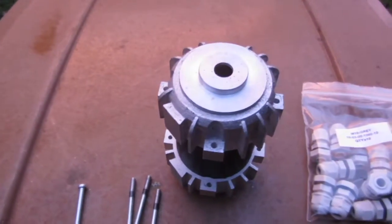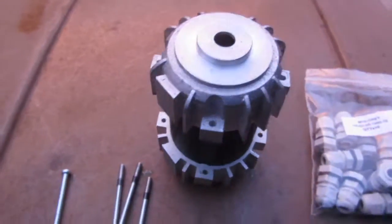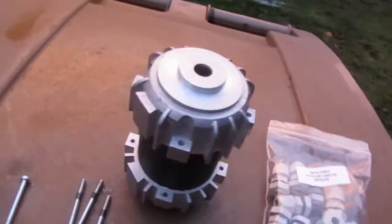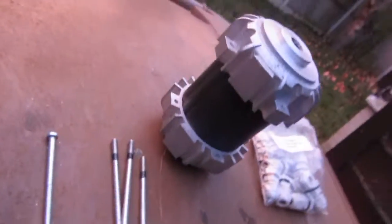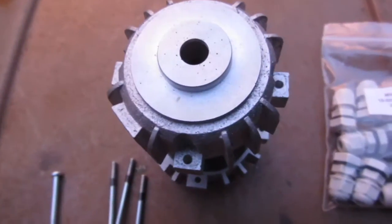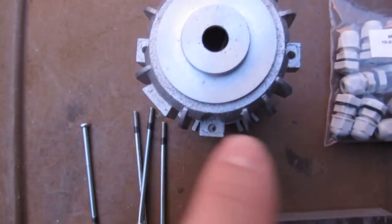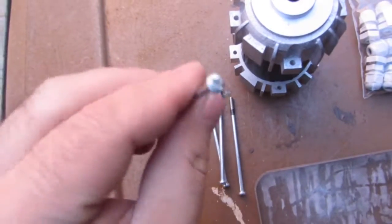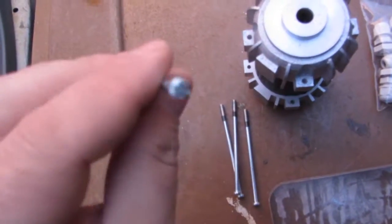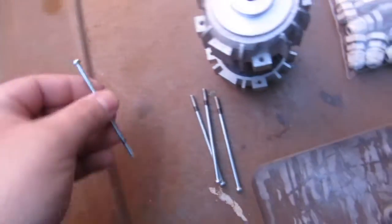That's the electric motor end shields we cast last month. They've been cleaned up. Motor's almost together, but it still needs some work with the drive shaft and the rotor inside it. But these castings are looking nice. 4 screw holes to screw the motor together with these screws. M3 times 1 thread.